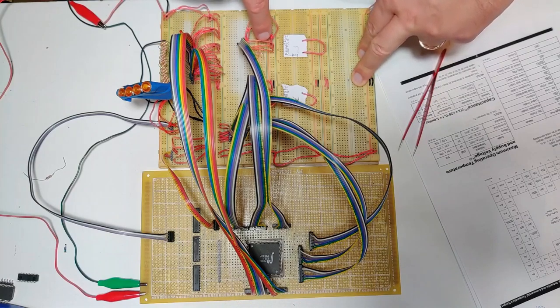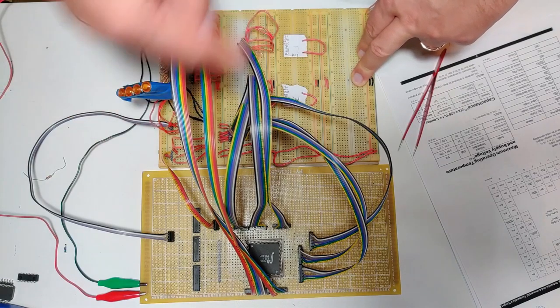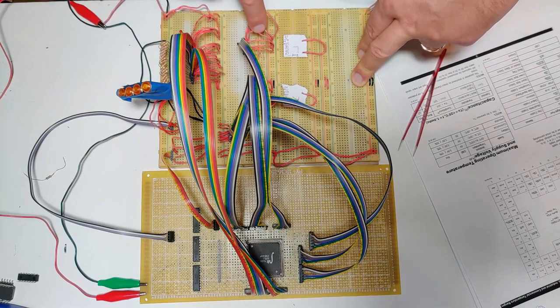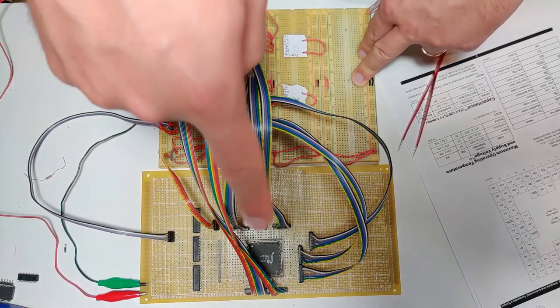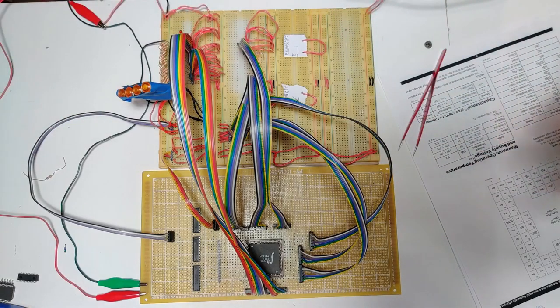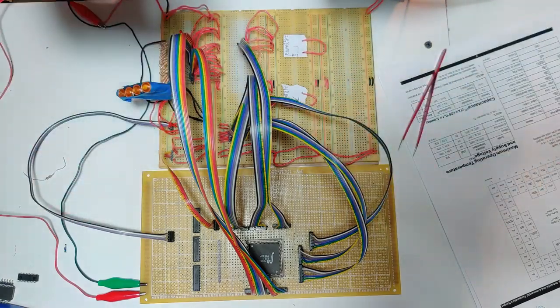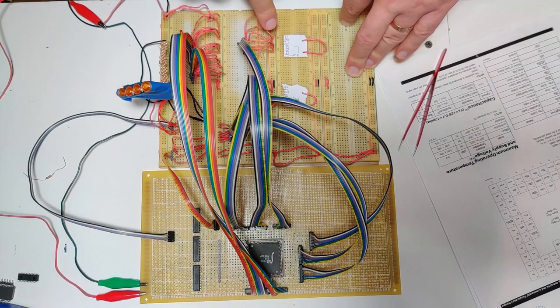They're active low signals. Then there's chip enable. I'm just having chip enable always enabled because I always want to be reading from this side of the chip. There's this semaphore line, which is a cool feature of this chip that I will never use. It has the hardware for semaphores, which means you can implement things like mutex locks in hardware. We have read-write, which is currently tied high, again, all of these are active low signals. When you bring it low, that means I would like to write into memory. We're not writing on the video side, we're just reading, so skipping that one.